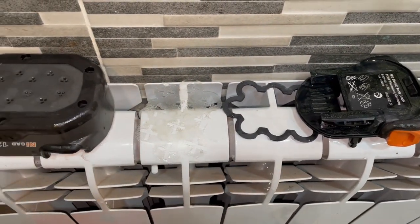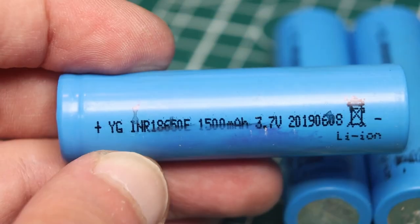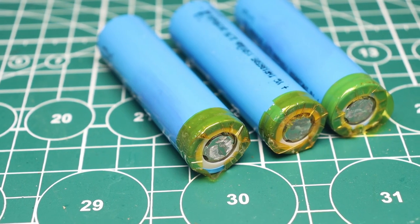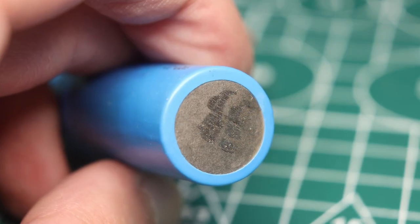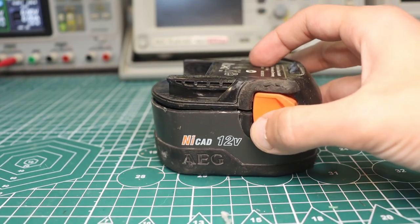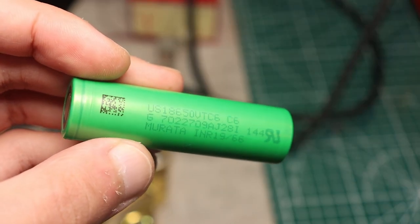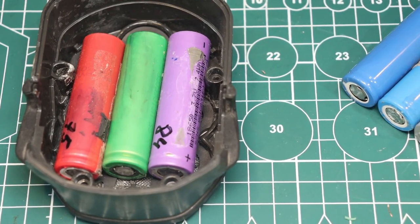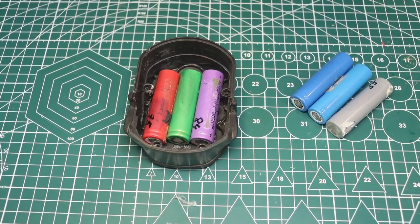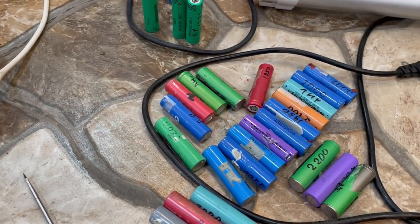While the battery case is drying, let's make the battery itself. I have high-current 18650 cells which can be easily discharged at 15A, and perhaps I will use them. The problem is that the capacity of these cells is small — only 1500mAh — although this is even more than the capacity of the original battery. I could insert more capacious high-current cells of 3000mAh or more, but recently prices for such ones aren't encouraging.